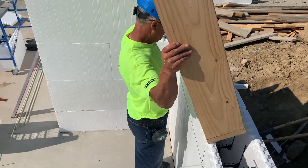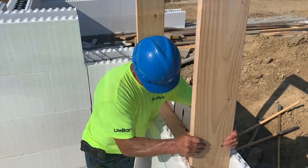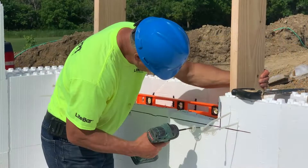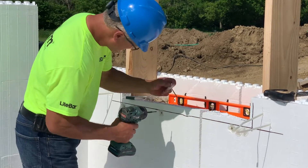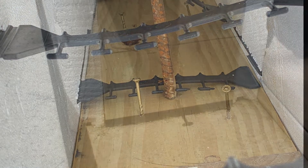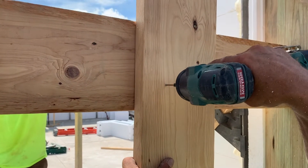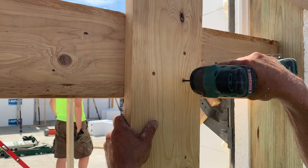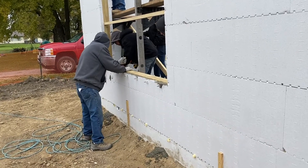Bulkheads for doors and windows are constructed using dimensional lumber cut to fit the form cavity. A 2x10 plank was cut down for this 8-inch concrete wall. Before anchoring, check to be sure the wood bulkheads are plumb and level. The forms are anchored to the jamb and header bulkheads with 3-inch drywall screws and plastic washers placed every 8 inches. To secure the bulkhead to the concrete, 4-inch drywall screws are attached so they extend into the concrete cavity. For door openings, the jamb bulkheads should be about a half inch short to allow the forms to settle during concrete placement. Bulkheads are temporarily braced with good quality 2x4 studs — vertical bracing a maximum of 2 feet apart and horizontal bracing a maximum of 3 feet apart. Window sill bulkheads will be installed later during concrete placement.